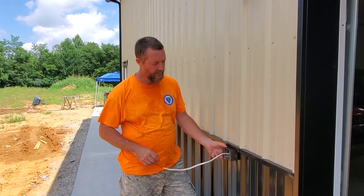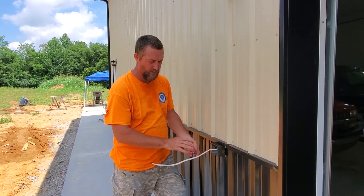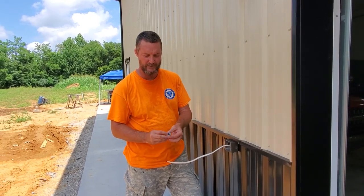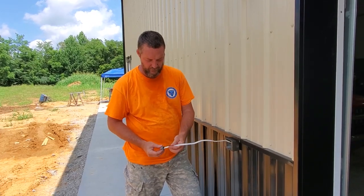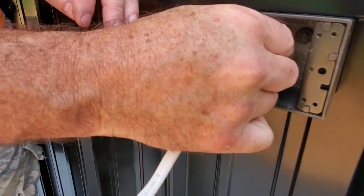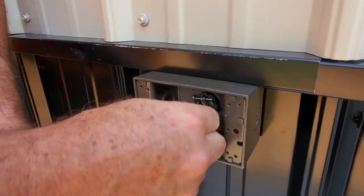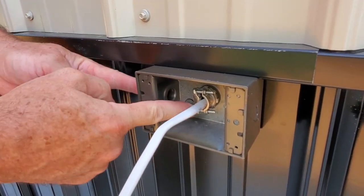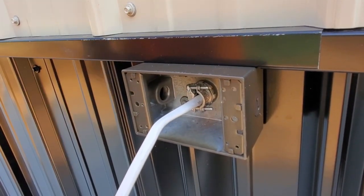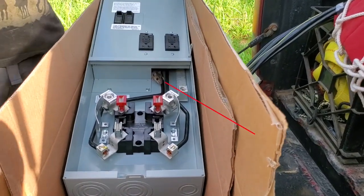All right, so we put the electrical boxes in. The hole that feeds the wire through, it's going through the metal tube. So we don't want this scraping against that metal through time or any chances of it. So I got the clamp down for wires that goes on. Usually you put these on metal boxes and then you run your wire through it and you screw it down, it clamps it. So we'll feed it through. And then on the back, if you notice, it is threaded back here in the back half. So we're going to put this back in here. That'll get threaded on. And then when we get it totally threaded in where you want it, we'll go through these side plugs that you could open up, reach the screwdriver in and tighten these down. And that'll hold that wire right in place, right where it's at. And that way the wire won't move in and out through time and keep it from shorting out. He's poking out.